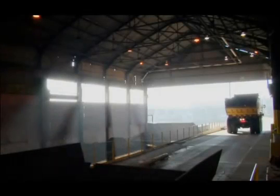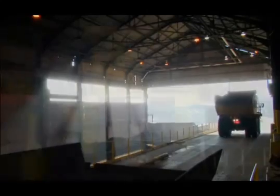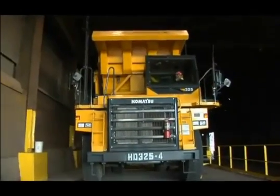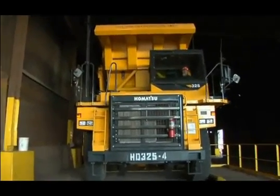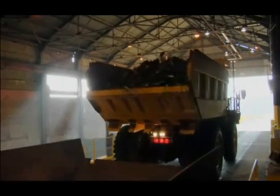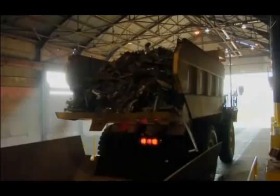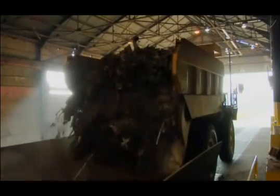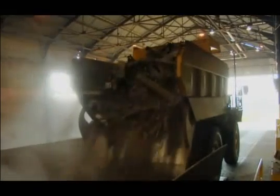The steelmaking process begins with our raw material, recycled scrap steel. The scrap is delivered in special trucks to one of our 2 melt shops at Harrison or Faircrest. For each heat of steel, we select the precise blend of scrap needed to achieve the desired final chemistry and properties. We use nearly 150 different classifications of scrap, each with specifications for chemistry and density.